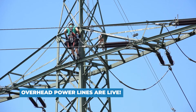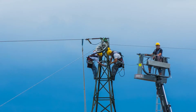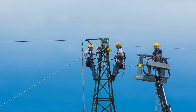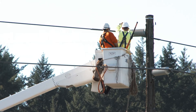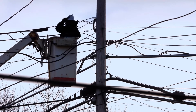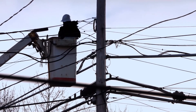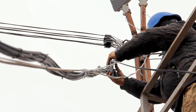Overhead power lines are live. Typically, overhead power lines will not be insulated. Most outdoor power lines are only weather-coated with no insulation other than spacers at utility poles. Because the lines are so high above the ground, this isn't a problem unless a worker touches them or they fall. While lines that could be touched from a rooftop or tree are insulated, that insulation deteriorates, eventually revealing bare wire. Approach all overhead lines with the full understanding that they are potentially lethal objects that should be left to a licensed electrician or utility worker.